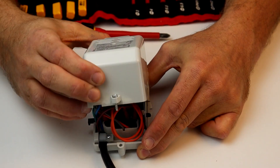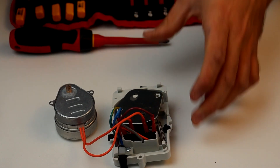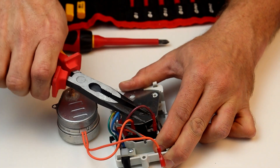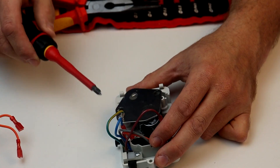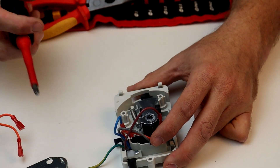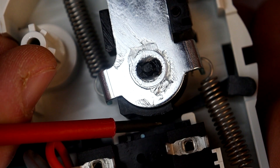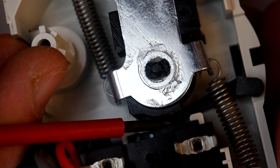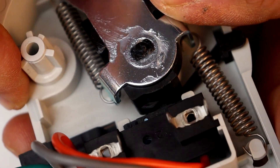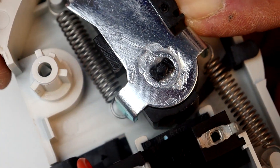By removing the cover you can see the synchronous motor, which can be removed by undoing two screws. The wires have spade connectors so can easily be removed should a replacement motor be required. All of the Drayton motorized valve actuators are Class 1 products, so it is important that they are earthed due to the internal metallic components. Here I have disassembled a ZA5 and you can see the small micro switch that the grey and orange wires are connected to, which is actuated by a cam when the valve is driven to the B position.